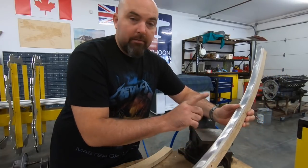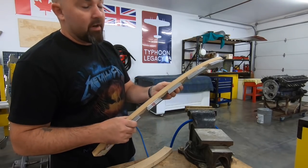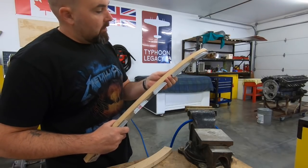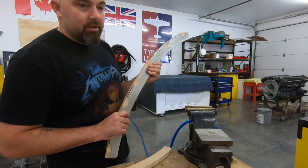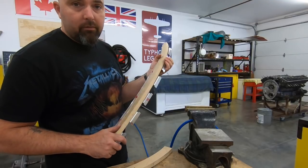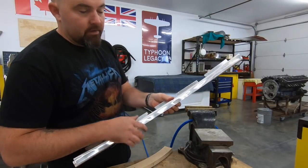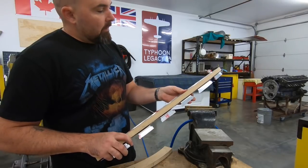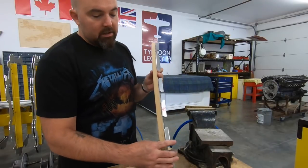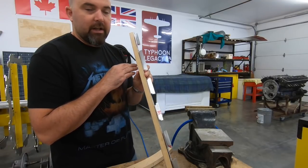I'm still happy that this has a little bit of extra stretch in it, because that next angle is going over and it's going to stretch — and it's a really difficult one to get the stretch onto when you bend it 90 degrees. There's no way to get the jaws in there, so it's more of a hammer form and a roll form. I should also point out that you don't want to leave things — say that shrink flange — when there's still a little bit of work to do and then move on to the next step.